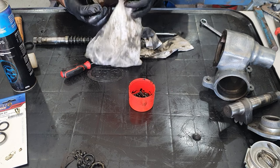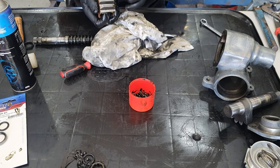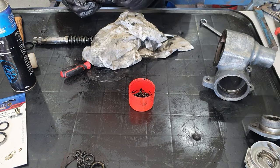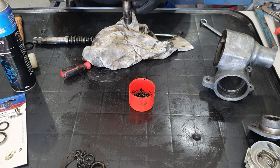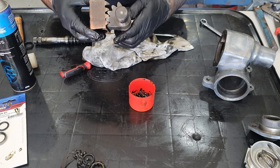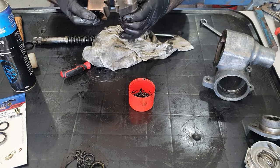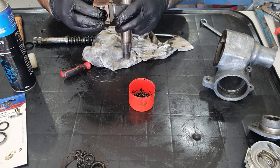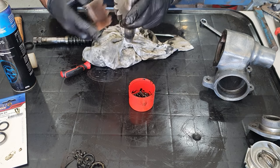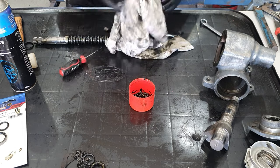You're left with the ball screw nut which is this part here. As you can see it doesn't show any wear on the gears there. It has a small mating face where you can see the opposing part has been running. As that ball screw is going back and forward, it's actually driving this output shaft. So this part here is the screw turning from your steering wheel - as it screws up and down like this it's turning the shaft, which turns the output shaft, which steers your car left or right.